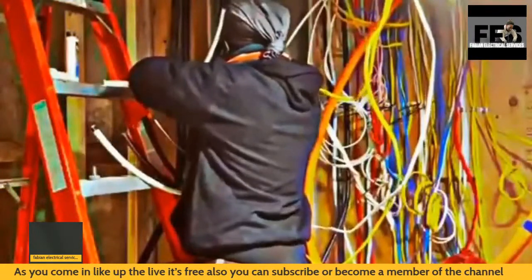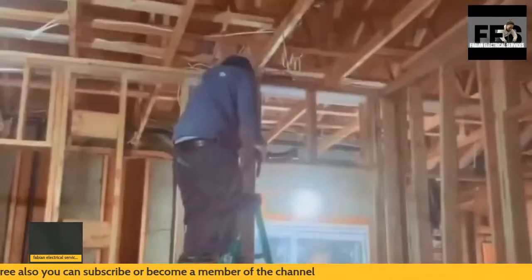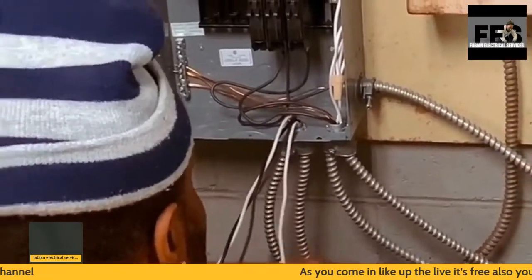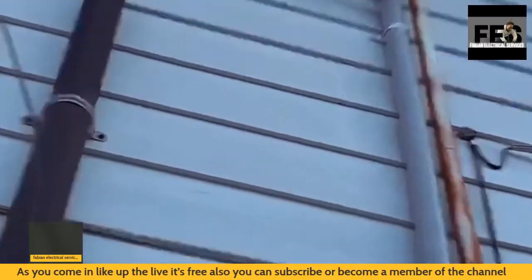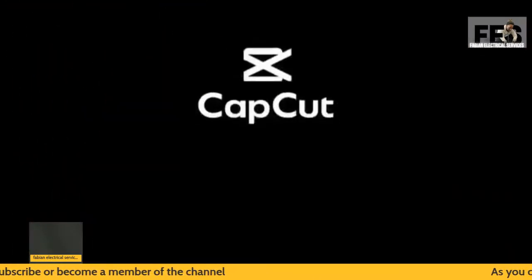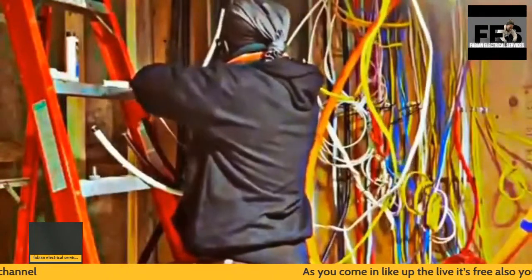Then we'll move into a 400 amp panel installation. I'll show you how I landed 250 kcmil cable using a Milwaukee drill to secure that panel by yourself. And last, we'll go deep into the 400 amp disconnect installation, focusing on phasing your neutral wires, avoiding common mistakes, and saving yourself hours of troubleshooting. If you ever wonder how to wire a panel, test a disconnect, or install heavy duty service, this is a live stream you want to stay locked into.